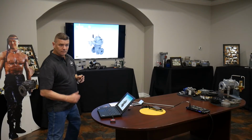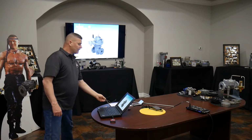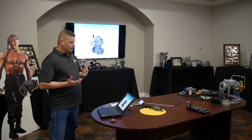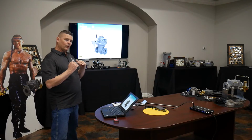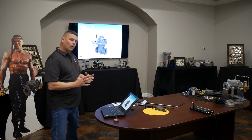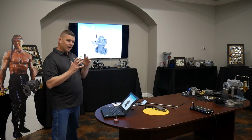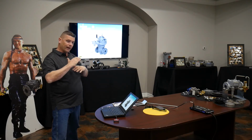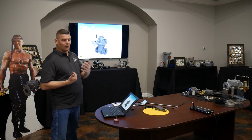Hey Jeff, did they keep the foam gasket that came around where you open it up still? Well, it's completely changed the way you get into the valve. Really? So yes, as an example, you have two choices, and you'll see this later. If you just want to get into the body and inspect the area around the plug seal, the whole thing comes off and you have a real gasket there. And if you just want to look at what's going on with the diaphragm area itself, then you just take off another section. With the other one, it's a little more involved.